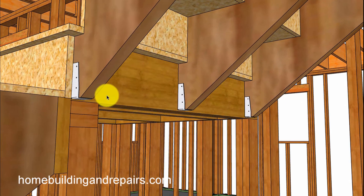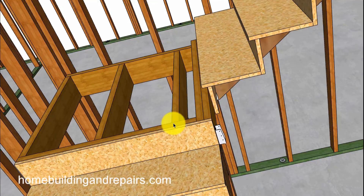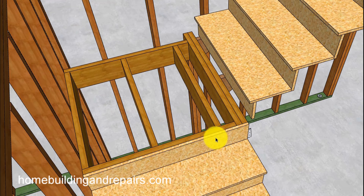Down at the landing, we doubled up a joist and it's sitting on top of two two-by-fours. You could put a post there sitting on top of a wall, and we're using inverted hangers. You wouldn't necessarily need an inverted hanger here, but you might need one on the end. Here you can see the doubler that's supporting the stringers.